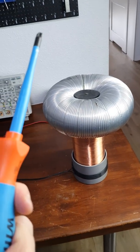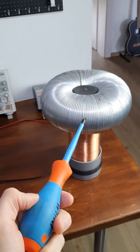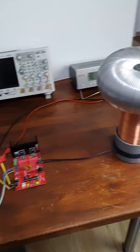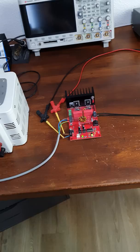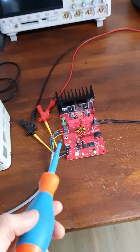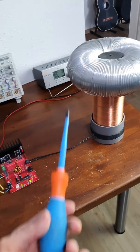The result is — I think it does perform better. I'm using, once again, 25 volts AC as input and the arcs at the output are actually not that bad. I thought the horrible construction was the reason why my old Tesla coil didn't perform that great. But with this driver, maybe I should consider building a new one with gate drive transformers — that's a lot simpler than doing bootstrapping. Maybe something like this could be produced as a kit. This is only a half bridge; maybe a full bridge would be kind of interesting. Let me know what you think.